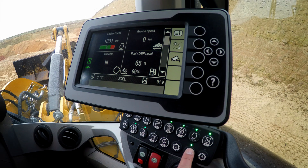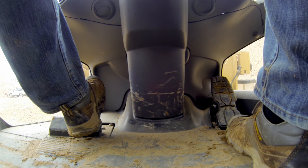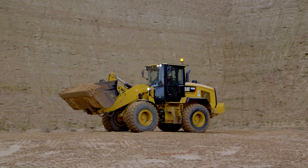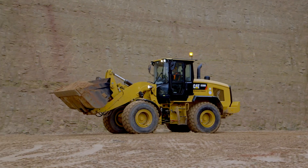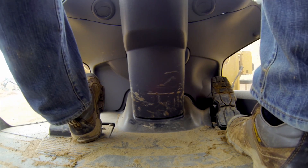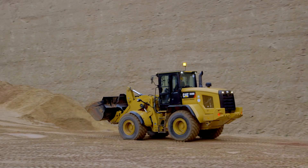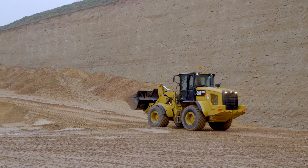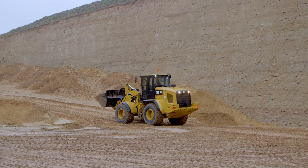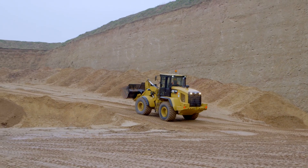Here in this example, I'm in range three. I've got my ground speed pedal pushed all the way to zero ground speed and I'm going to put it in gear. Now it's not going to move until I modulate that left pedal control. So as I let my foot all the way off, the machine will go maximum relative to the ground speed. But as I use my left pedal control, notice that I can control my ground speed completely independent of engine speed, giving me excellent control of both wheel torque and ground speed to meet any application requirement.